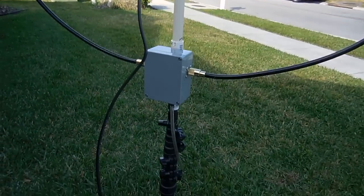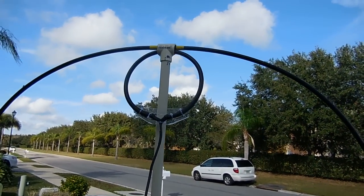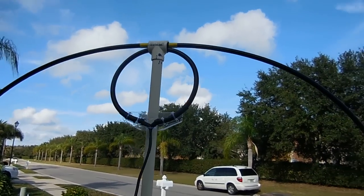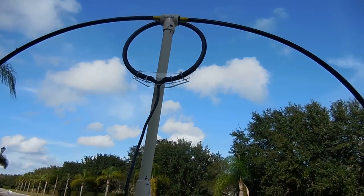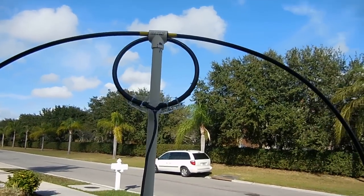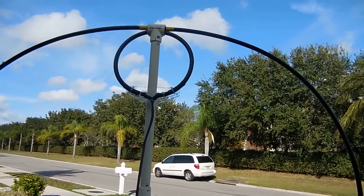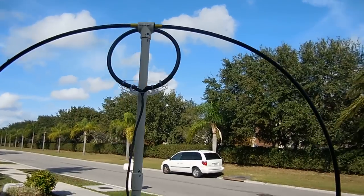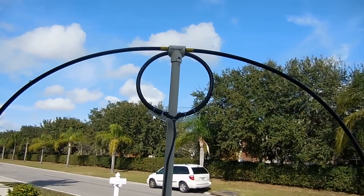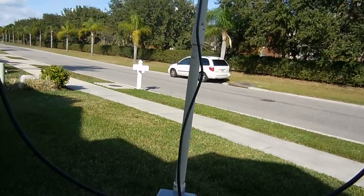That's my antenna — I'm kind of excited about it. I had a problem when I first built it: the SWR wouldn't get below 1.7. I thought about it and realized it's basically a transformer when you consider the inner loop and the outer loop. So I figured let me play with the loop length of the center conductor of the smaller one. I stripped back some of the coax to use alligator clips and kept clipping up and down, and it came into 1.1. I said, well, that's my issue — so I cut it to the right length.